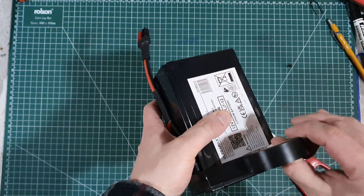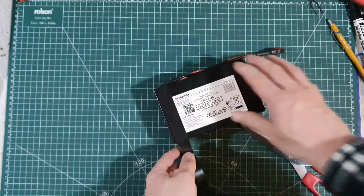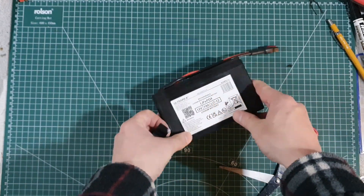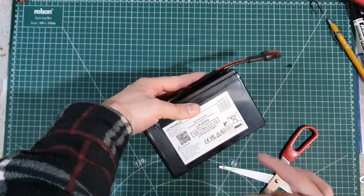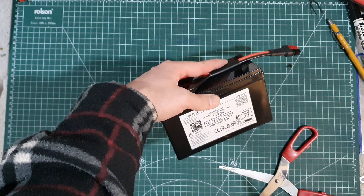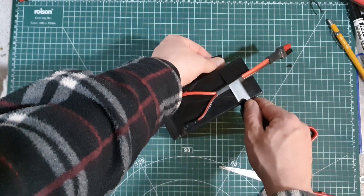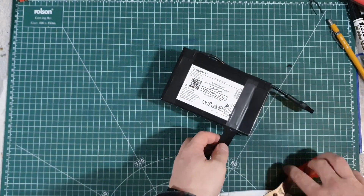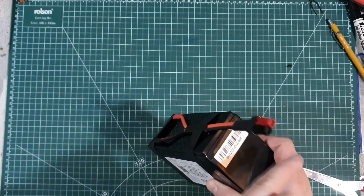From the specs, this battery is only rated to 10 amps continuous draw. So if you wanted to use it with a 100W radio requiring maybe 20 amps, it wouldn't really be suited for that. The bigger batteries — the 22Ah version — I believe you can draw 25 amps continuously, which would be more than ample for a bigger radio. So there's our battery, now secure, and you can see moving it isn't going to put any strain on the terminals.